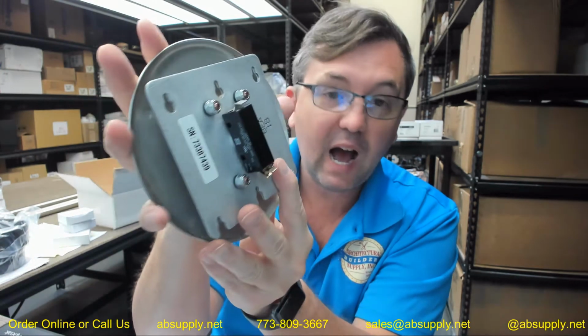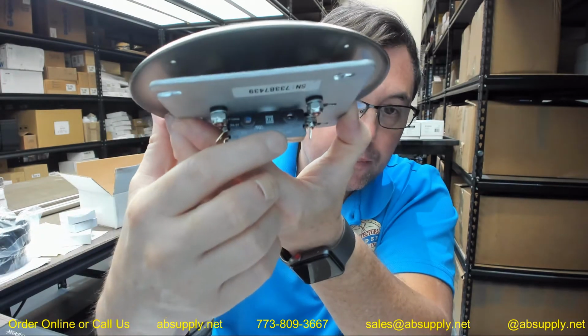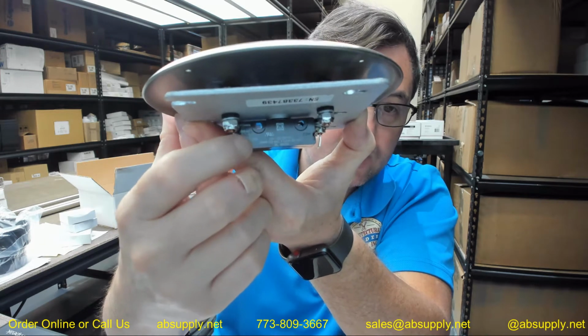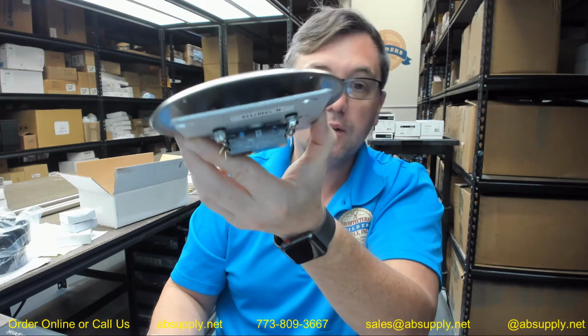The transmitter really has what's called a cherry switch, and these are available as separate standalone items. You can replace these. They're very inexpensive, and they do fatigue and need to be replaced. They will break down. It's not unusual. You're going to have a common, obviously: COM, NC, and NO. Normally open is going to be pretty typical for such a situation.